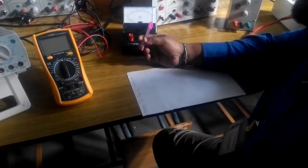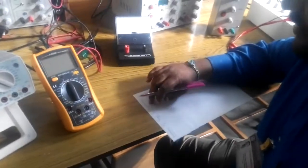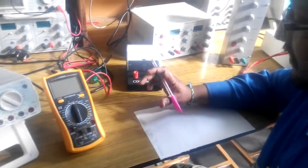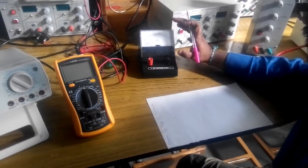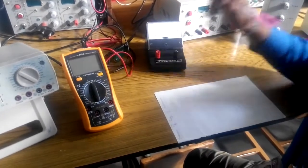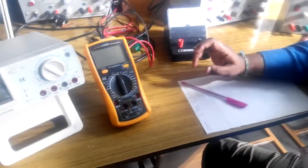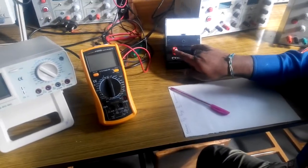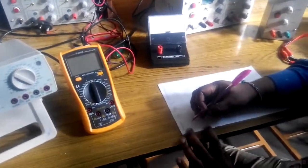The galvanometer shown here can measure a maximum current of 250 microamps. In certain applications we need to measure even greater values of current. To extend the range of your galvanometer, the simple thing you can do is connect a very small resistance in parallel to it. By connecting a small resistance in parallel, you can extend the range — the smaller the resistance, the greater the range of current that can be measured.